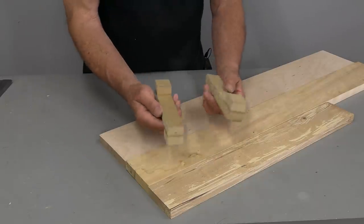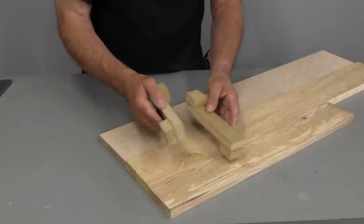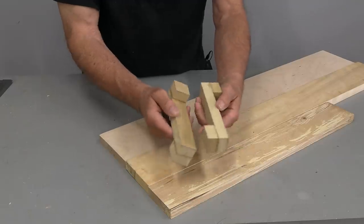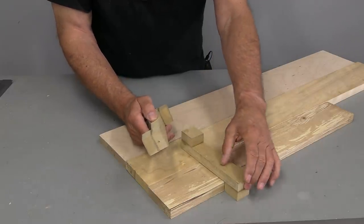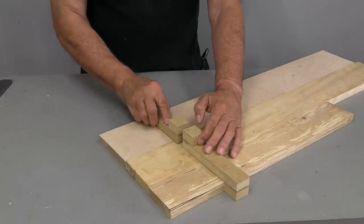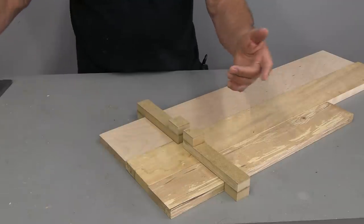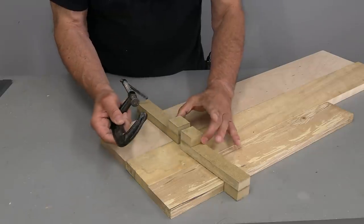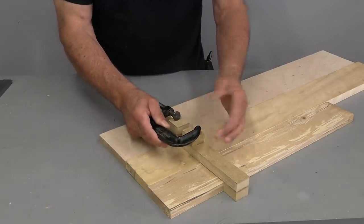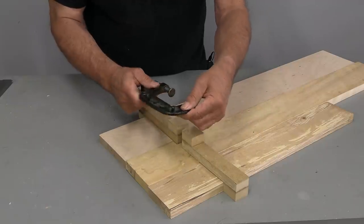When I first saw these, I thought these are really not a good idea. Now here's what the purpose of these are — let's call them little clamp extensions. You put one on that side and one on this side, and now instead of buying expensive wood clamps, you could use C-clamps because now you just need to squeeze this part together. You can use an inexpensive C-clamp, which you probably already have.